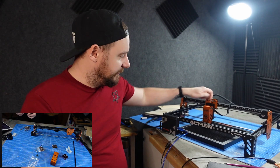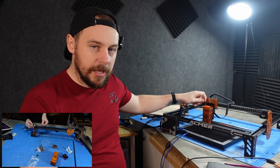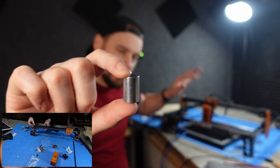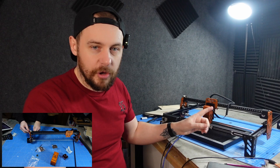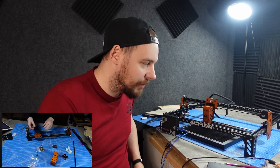To align the actual laser itself, it's adjustable on the side so you can move the laser up or down. To get it in that sweet spot, they send you a small aluminium cylinder - you just loosen the laser head, lift it up, put this underneath so it touches the bottom of the material, the laser touches the top, then tighten it up and take it away. That gives you the perfect focal length to run the laser, whether you're cutting or engraving.